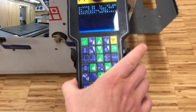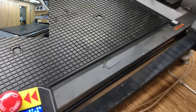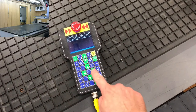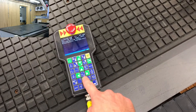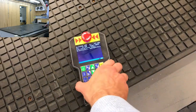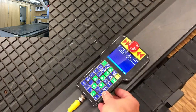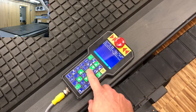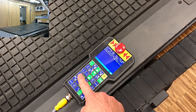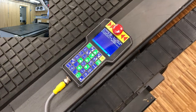You can fetch the controller and move with it further down, but not further than the cable allows. Generally for X positive, X negative, Y positive, and Y negative directions, it is easier if you hold the CNC controller oriented so you know that jogging positive X moves that way, negative X that way, positive Y that way, and negative Y that way. The Z axis usually causes little confusion.